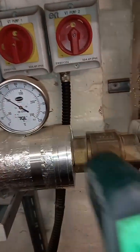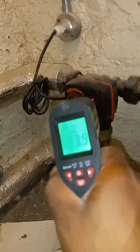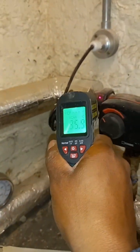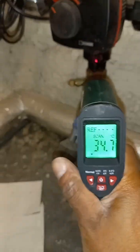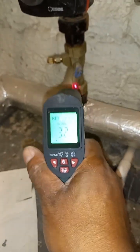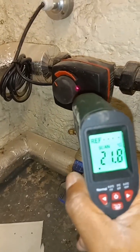And then this is my heating side, so this should start going up. As for over this side, my SB valve should be letting heat through once the boiler comes on to satisfy the calorifier and not bypassing it back to the return — it should be all coming through here. They're in automatic mode rather than manual mode.